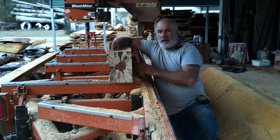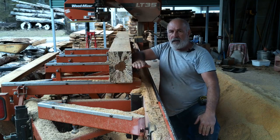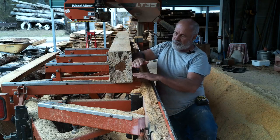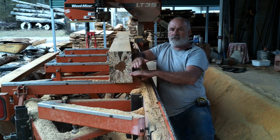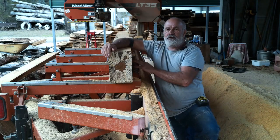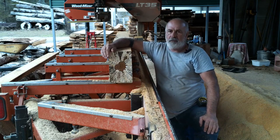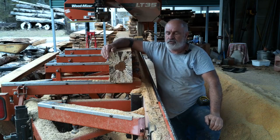Okay, so I don't know how well this is showing up, but my backstops are about this high and my clamp on the other side's about right here. And that's how I always try to do that, to where my clamp is lower than my backstop, so that my backstops, I can see those easily. I can't see my clamp very well without, you know, sticking my head over on the far side, and then I'm not paying attention as closely as I should.